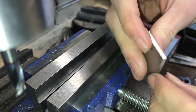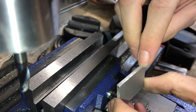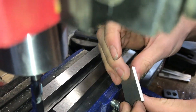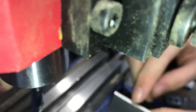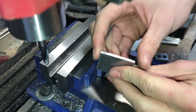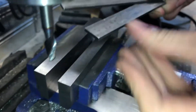With all of the burrs removed we're ready to put it into the vise. I'm going to be cutting off one side and flipping it over and cutting off the other to make sure that both sides are flat and parallel. Normally it wouldn't matter which side you start with, but in this case I have a machined or at least partially machined edge on this side so it'll be a little bit flatter than the rough hacksaw cut. So I'm going to put my flatter side down in the vise and I have these two parallels here.